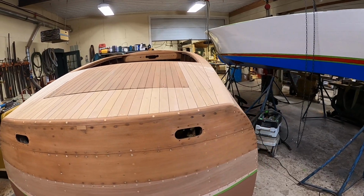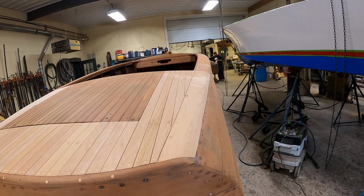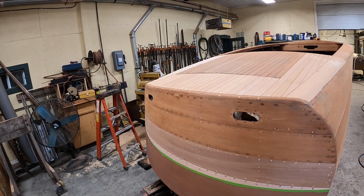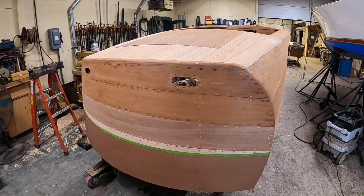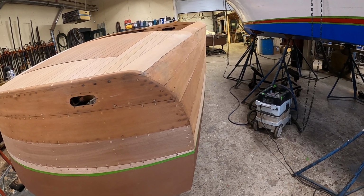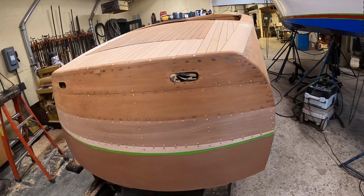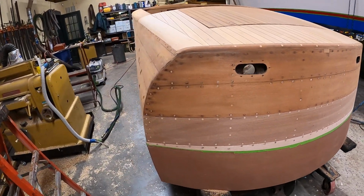He's cleaned out the surround yellow seam channel, and we'll get to the foredeck in a minute. But at this point, his next step, he and Rick, will be flat sanding using our 18-inch Hutchins pneumatic longboard. You wanted to use a longboard, otherwise you get a moonscape.